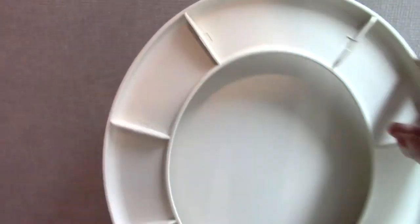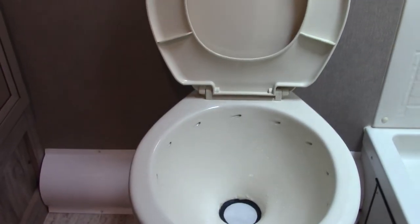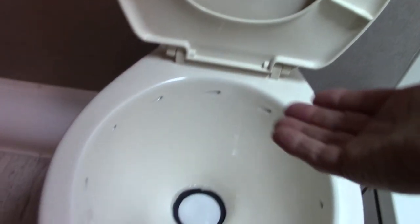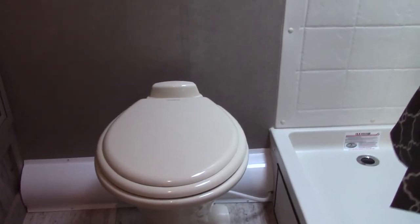The sink and shower work like any other sink and shower. You do have a vent here with a fan — run the fan when you use the shower to pull the humidity out. The toilet is actually nice — it's ceramic, not the cheap plastic one. The black tank is directly below the toilet. The thing you have to know is it has to have chemical and a little bit of water in it before you start using it. When you get to the campground, hook up your power and water, put one dose of chemical right in there, then step on the pedal and hold it — water will come swirling out, and put about a gallon of water in the tank. You have to have some water in the black tank with chemical before you start using it. If you ever dump the black tank and you're going to continue to camp, come in here and repeat the procedure: put some chemical and some water in there.